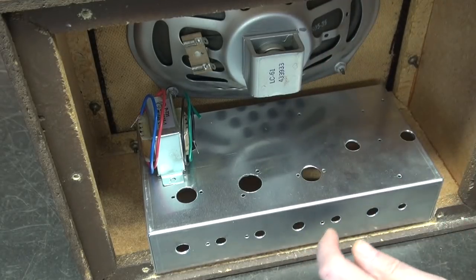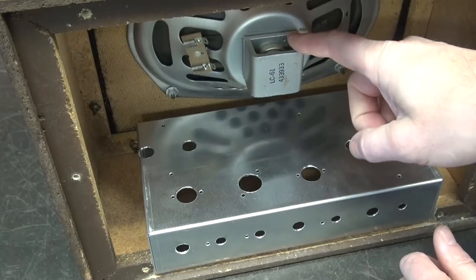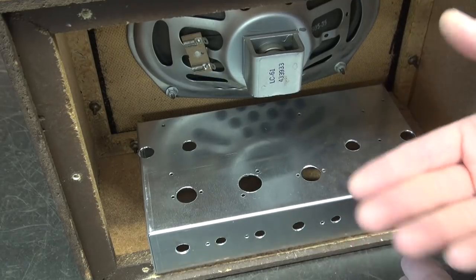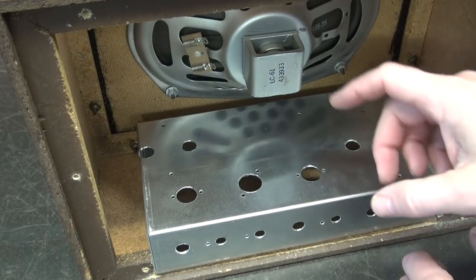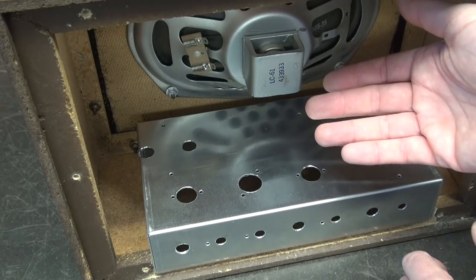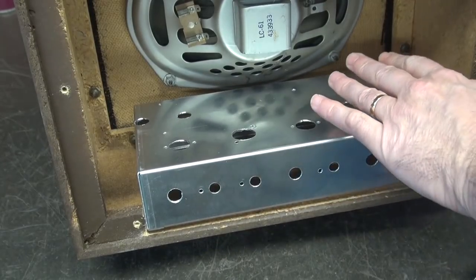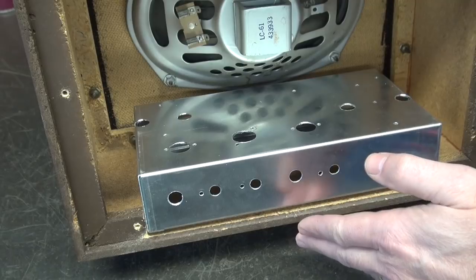Let's review the chassis layout a little bit closer. I kind of arrange things in a C shape going around that speaker, and I try to leave as much clearance between the magnet, the chassis, and the tubes as possible. That way, if somebody wanted to upgrade the speaker in the future, most new speakers have a big ceramic round magnet, and if things are too close, they can't change the speaker. Also, this cabinet is acoustically perfect for a 6x9, but make sure you mount everything solid because that 6x9 could have a tendency to rattle things.